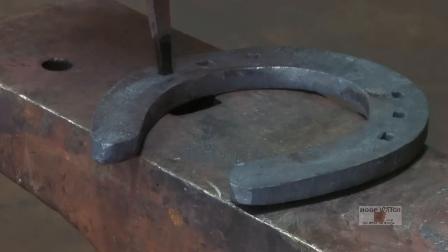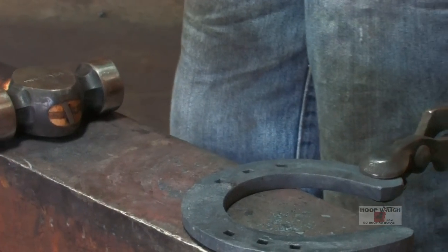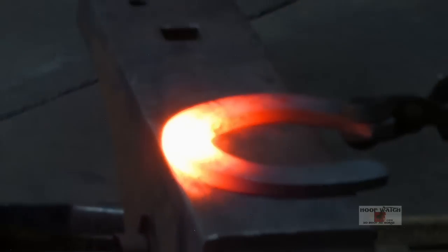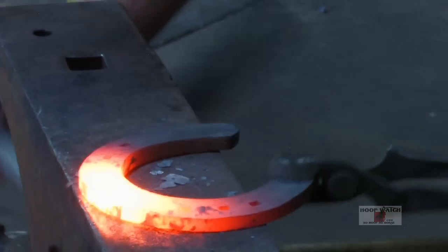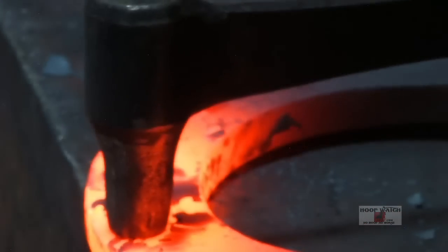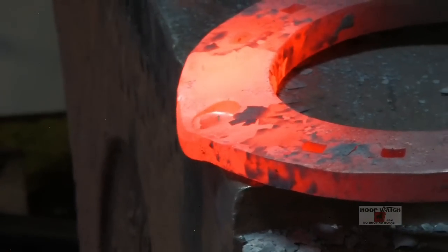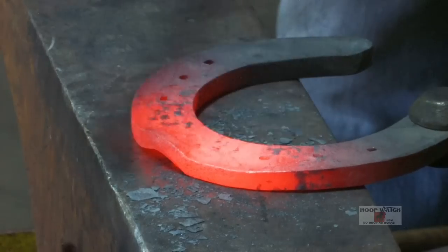I'm going to put a little bit in there and then I can open them up when they're all the way bottomed out. I've got one more heat and that one more heat is a bob punch — after I bob punch it, I'm going to create the whole shoe around the bob punch. I'm going to come in here and cheat a little material out — it's the last time I got a free go at this so I just want to make this extra nice. Take my Flatland Forge bob punch. I've got my lip there — just come here with the hammer on the soft little lip and just push it in.